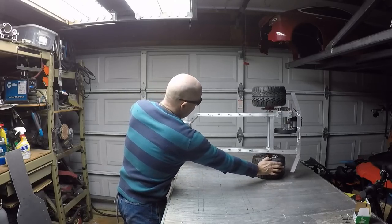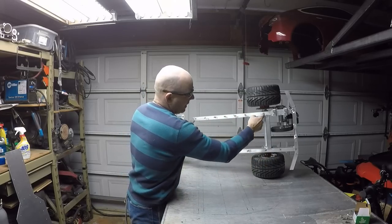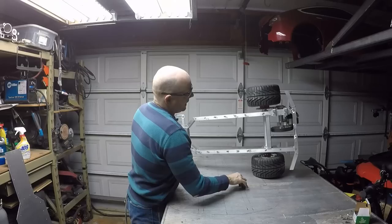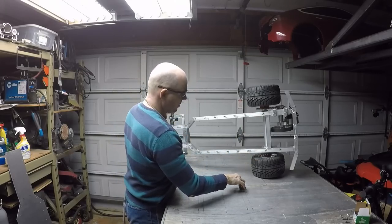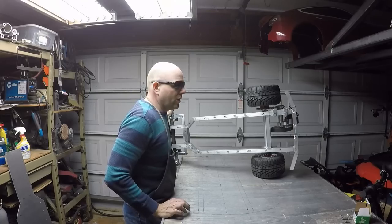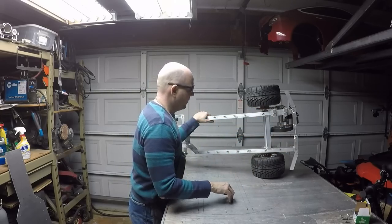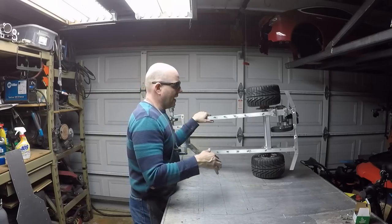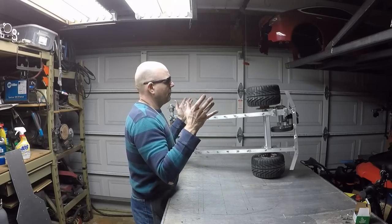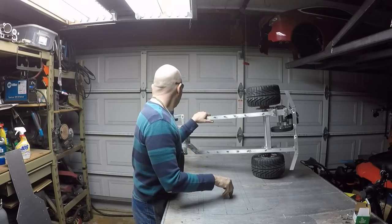I got the pan finished. I got all of the threaded inserts installed and ground down flush. I got this last frame support in, which is also a battery capture rail. I've also welded up a few more frame seams. For the next video I'll be finishing up the welding, doing all the gussets, and a lot of the detail work I've been putting off. Beyond that it will be mounting the body. It looks like the body will ride slightly up above the lower pan, so I'll be making insert plates that attach to the body and also to the chassis, making the body easy to install and remove.